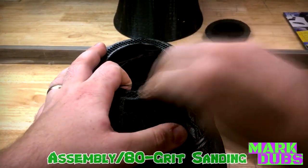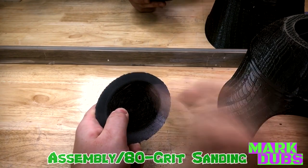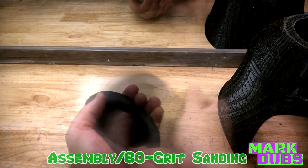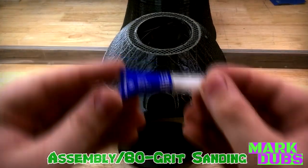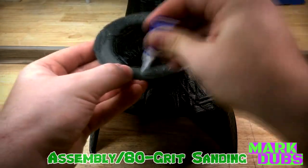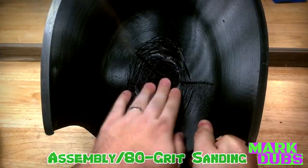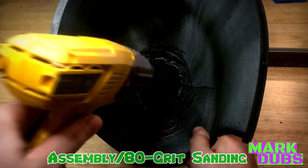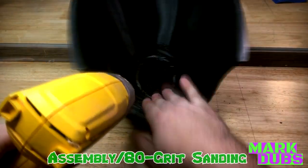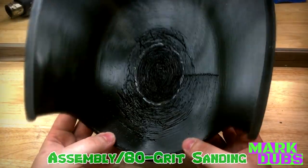To kick things off, you may have noticed that a few of my prints did not finish as originally intended. There were instances where the hot end of my printer stopped extruding and I had to restart the print as close to where it left off as possible. To briefly explain what was causing this: filament printers have to retract filament from the nozzle to prevent oozing. If the retraction distance is too high, it can cause filament breakage at the extruder end — which is precisely what was happening. Unfortunately this was not corrected until well after this model was printed.